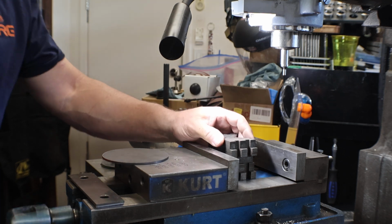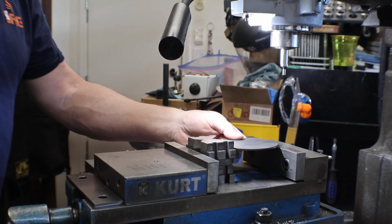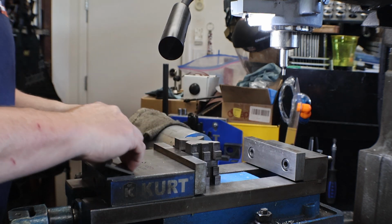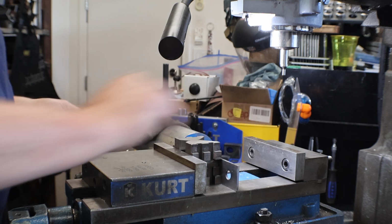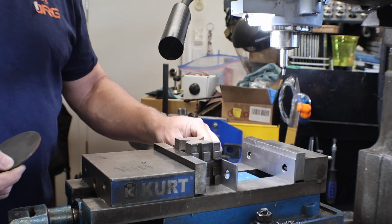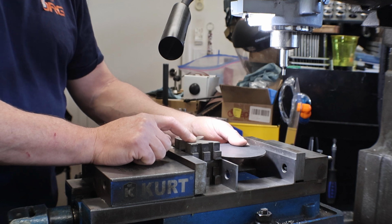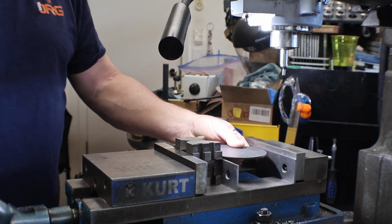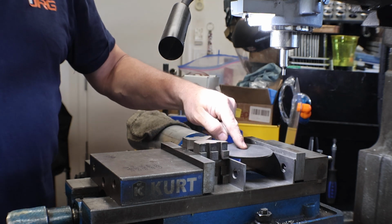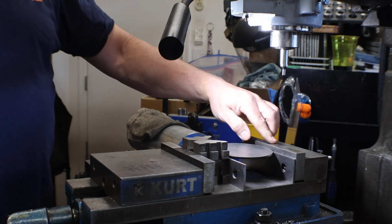you're going to use a V block to hold the material better. And then you're going to use parallels to raise the material up. Plus, this parallel is stood off from the point of the workpiece because of the V-block, and that'll keep it from wanting to flop. If you put the V-block on the movable jaw, your center stays the same. Probably technically stays the same the other way, but you always want your reference to be the fixed jaw.